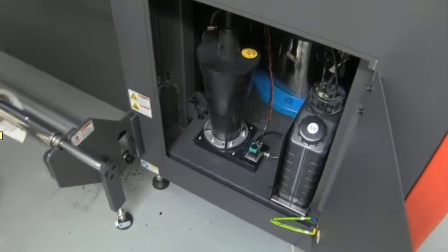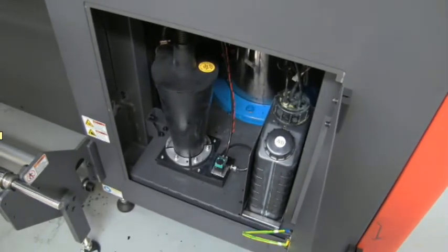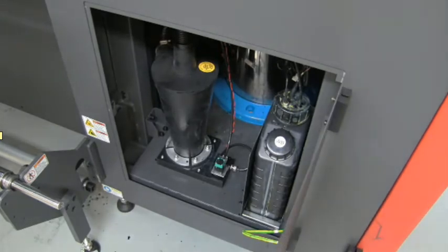At the end of every work week, there's a liquid separator button at the front of the press that you're going to want to engage. That turns on the small pump next to the secondary waste tank and pumps the ink from the left-hand waste tank to the main waste tank. There is ink level reporting back to the software, so you'll get a readout on your waste bottle as well as your ink bottles as percentages remaining.